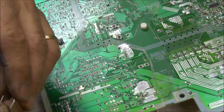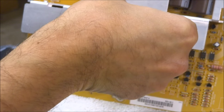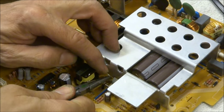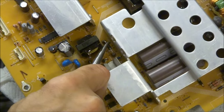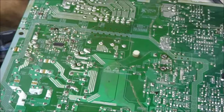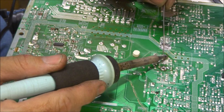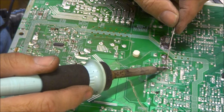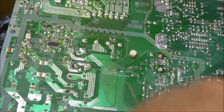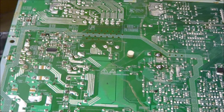Get your part formed and ready to go. Pay particular attention to the polarity of the diode — the band is the cathode side, and it's marked on the circuit board as such. Make sure your standoffs don't fall off; if they do, make sure you stand the Zener diode up off the circuit board because it generates heat — it absorbs reverse transient voltage and generates quite a bit of heat. Solder it fairly quickly so you don't overheat the diode. Once done, trim the leads. Make sure to skim off all excess solder that was used when flinging solder out of the circuit board.